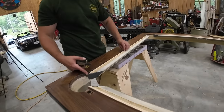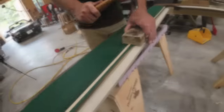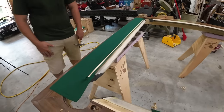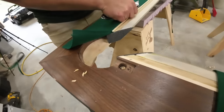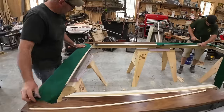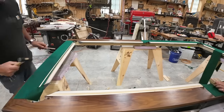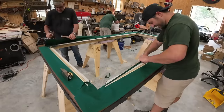Now it's time to install the felt on the bumpers — the felt gets installed from the top, wraps down and under, and gets stapled on the bottom. There's a very clever technique: you bang a batten into that little gap that's created when you glue on the wooden part that has the bumpers glued to it. If you scroll back you'll see there's a gap at the top of each one of the rails — the bumper rails — and that's to accept the material and a stick, which again is another thing that gets supplied to a company that makes pool tables.